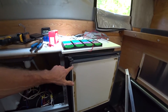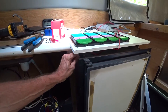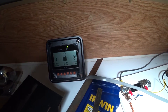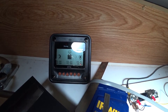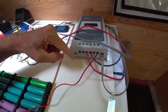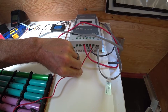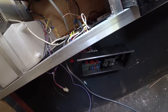For my final test, I have my 12-volt refrigerator wired up. Hopefully I have the right gauge wire — it's pretty thin but it's not getting hot. I forgot to fuse it also. Right now it is pulling 7 amps and the voltage is down to 14.9. I plugged it into the load side of the Tracer MPPT solar charge controller, and it's running the refrigerator off that. Later, the load side will go to my power panel and distribute electricity from there.